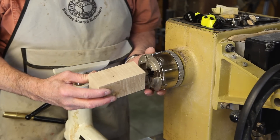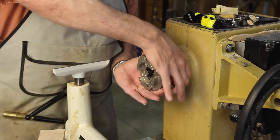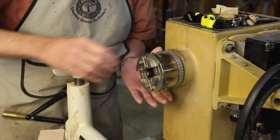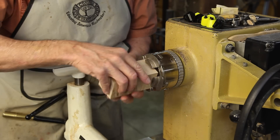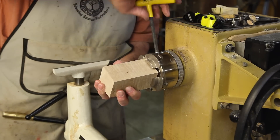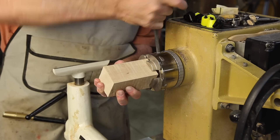Another innovation is that it has a zoom feature which allows coarse adjustment of the jaws very quickly by turning this ring at the rear of the chuck. Like any other good quality scroll chuck, it is gear driven for the final tightening with a hex wrench.